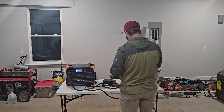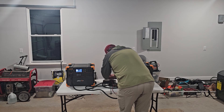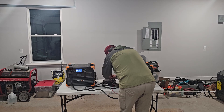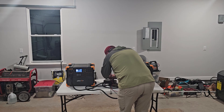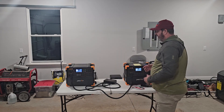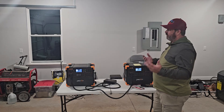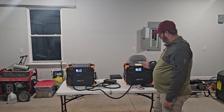This is still beeping. We're going to go across. Right now it's saying 112.1 to ground. And then this has 98 volts to ground on that other line. I have 61 volts — it looks like neutral to ground. And then between the two units, it's sitting at 110 and dropping. I don't know if that's because we don't have the data cable connected. I'm going to depart from what they asked me to test, because this unit no longer has the inverter fault.